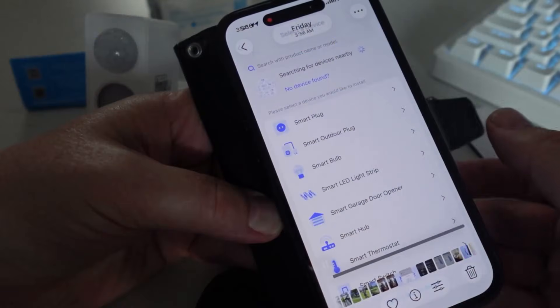To understand the setup, there are a couple of things to work out. First, connect the device to the Meros app. Next, connect it via Matter over Thread — I'm using my Thread border router inside my Apple HomePod mini, since I haven't managed to get Thread working directly with Home Assistant yet. I connect it to Apple Home first, then share it from there over to Home Assistant. Note that you need the Meros app to adjust sensor settings, and to connect you press the button on top of the device to pair via Bluetooth.